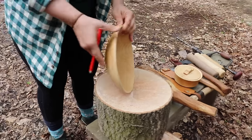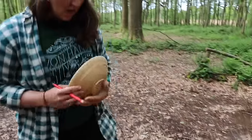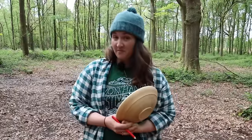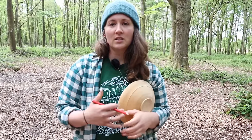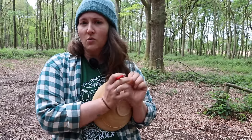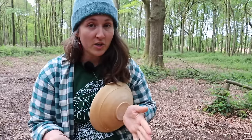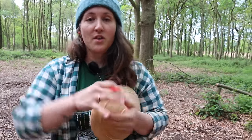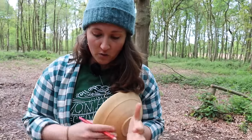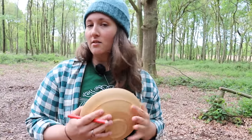In terms of wood selection, do you have preferences for the type of wood to use? Definitely have some favorites. The more and more we turned, the first years it was really nice to start with softer woods, like the softer end of hardwoods. So alder, willow, birch, which we still do enjoy turning, but we approach them a little bit differently. We usually let them settle or dry a little bit longer than we might with the harder end of the spectrum of hardwoods.